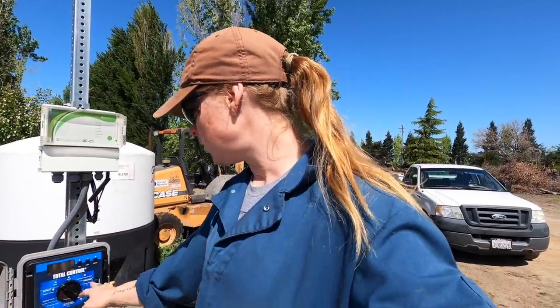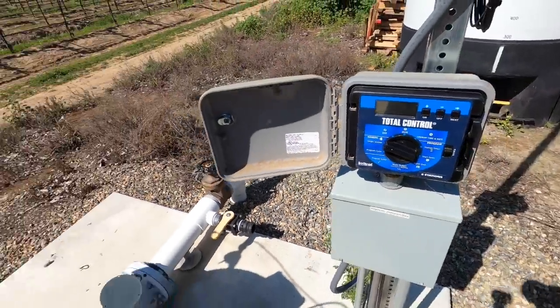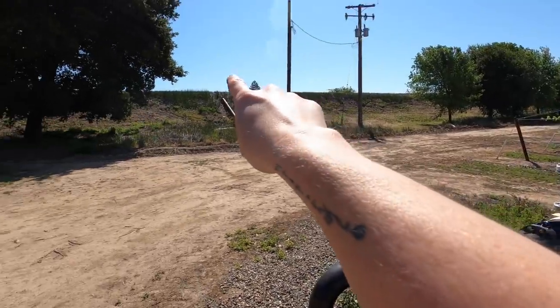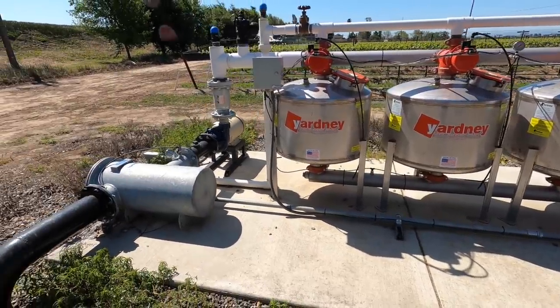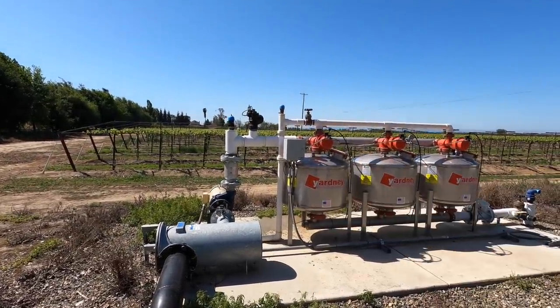I'm going to turn my panel on. I did everything yesterday — greased and oiled the pump — so we're going to turn this on manually. I should hear the river pump click on, then there's a little lull, and then my pump here to go into my drip line should turn on. Just heard the river pump. Now in a few seconds — I can hear air coming out of the little vent up there, starting to hear water in my filters. There we go. That's the danger zone, you never want to be standing on that side.